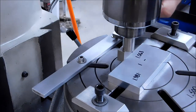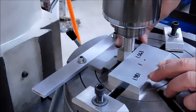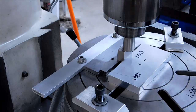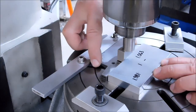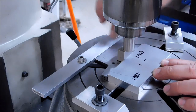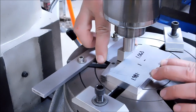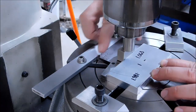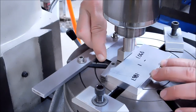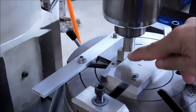So if you stick an adjustable parallel underneath it, or behind it, excuse me, and I know some of you guys are just cringing in your seats right now because you know where I'm headed with this. Squeeze that parallel, and if you have five hands, try to keep pressure against the pin, try to keep the parallel against the back rail, and just make sure everything comes home at the same time. But, here's the but, if you get a little too anxious with the adjustable parallel, you can push the part off the pin. Can you see the gap right there?